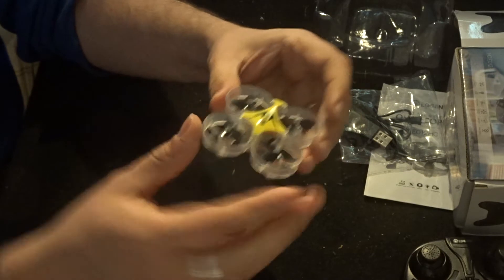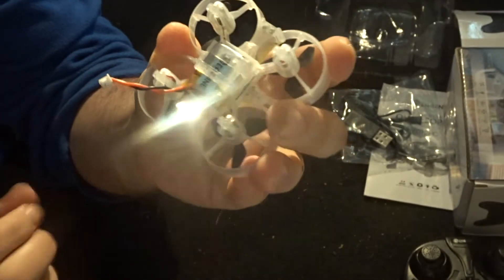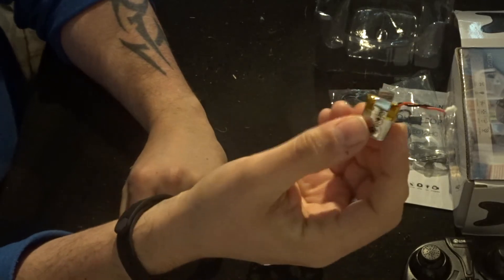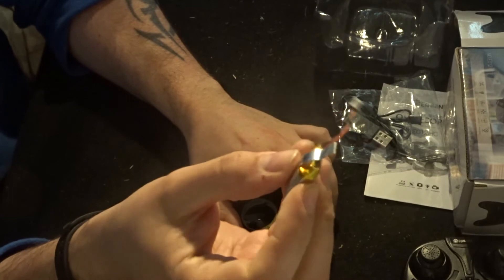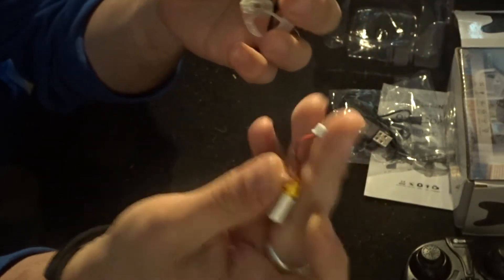If you hold it up and plug it in, there's a possibility it'll calibrate incorrectly and won't fly properly. It's a little fiddly because once the battery is in, you can't access the plug easily — you literally have to plug it in and then fit the battery underneath. Charge time is about 40 minutes, giving you a flight time of five minutes. You only get one battery with this model, so you can't stack batteries unless you have the correct plug. Five minutes is pretty standard for a nano quadcopter.